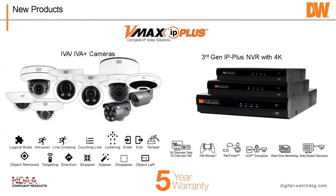And you'll need our second or third gen IP Plus NVR with 4K. There is a possibility one of the distributors still has a second gen unit, which the only difference is it doesn't have the 4K monitor support or 4K camera support. So if you're at least a bit worried about it, you can of course contact your sales rep or contact our tech support, and they can look at the serial number for you, just to make sure it's a 4K. I think everything out there now is 4K, so I don't think you have to worry too much about it. But just to give you a heads up.